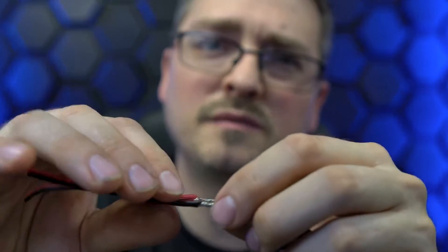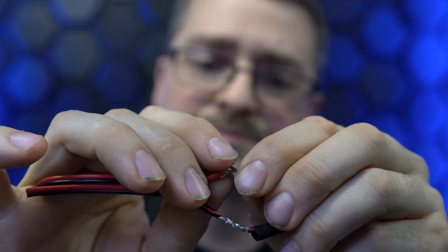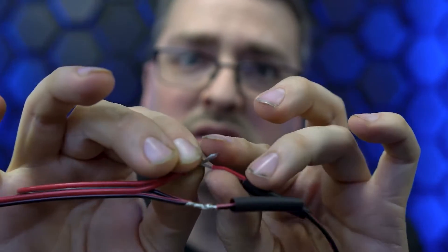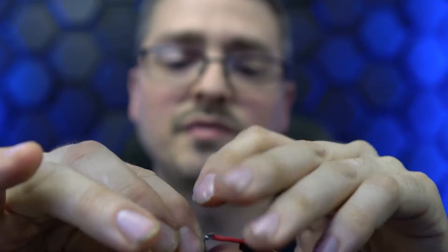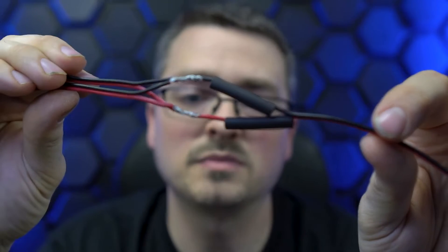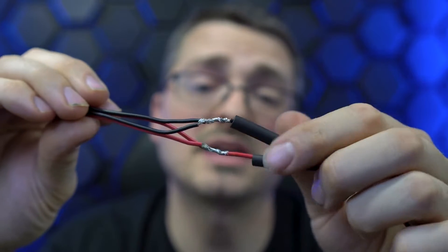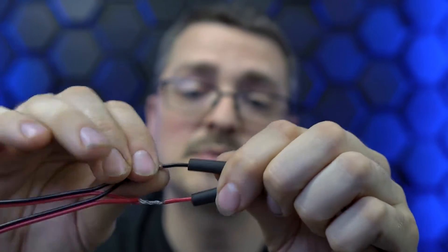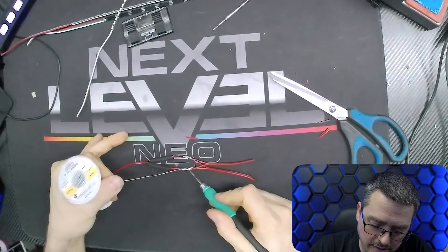You don't want to have a big ball of wire sticking together. The way I like to do it is I'll take these two wires and just start wrapping them around each other. Now this is very easy to pull out until you get the solder on it. So if you're not soldering — if you're just splicing wires together on a car and using electrical tape or something like that — you would not want to do this style. This style is really good if you're soldering because it keeps that low profile about the same width as the wire itself, but it allows you to solder them together in a way that it's not going to go anywhere.